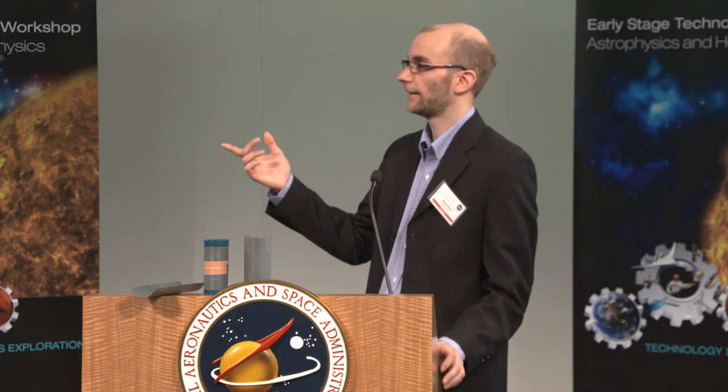As you preload the petals around that structure, they want to contract. And so nominally they'd follow a spiral around because they have to furl with the adjacent petals. But as you tighten that preload down, they're going to shear with respect to each other. And as I mentioned before, there's all that foam, so there's going to be compression happening where the load's being transferred, and as a result of where the loads are being transferred, what does the shape look like? On top of that, there's only so many places we can physically tie down the petals. You can basically only attach them at the root of the next petal all the way around. So it's not necessarily a perfect spiral.